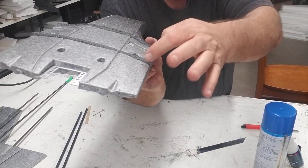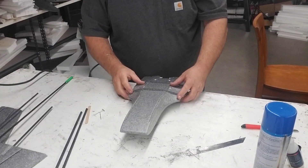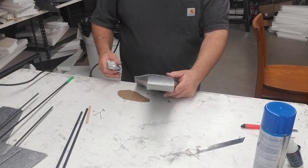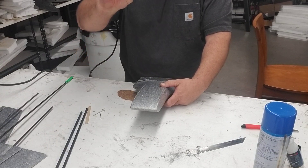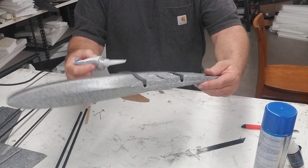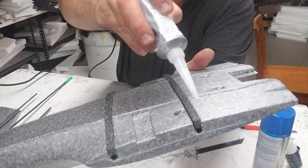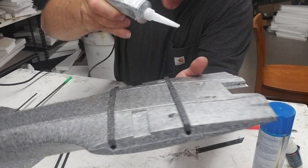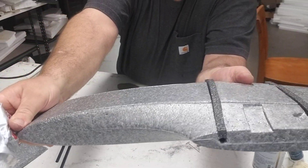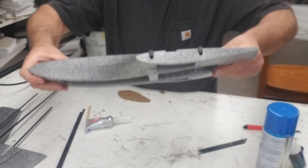The sleeves have been glued at each end with goop and held overnight while they dried. Now I'll spread this open — I usually lean my belly on it — take the goop with a long nozzle and spread the back end open a little bit, drop goop in there, then stick the nozzle down in here and put goop in here as well. Same with both sides — you can see how we spread them apart, put goop in, and flex them back together.